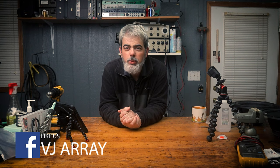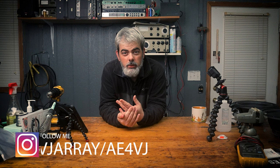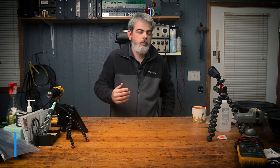Just tell them what speaker you got, and they'll tell you all the parts you need, depending on what the problem is, from voice coils to actual reconing to just the surround. You can do all of it. So today, what I thought we would do is let's recone one.